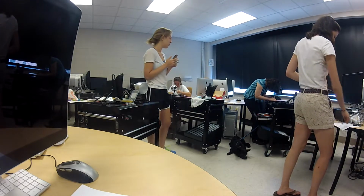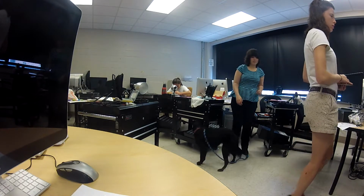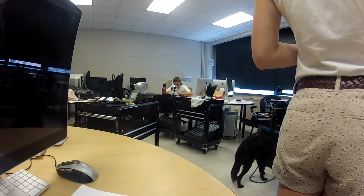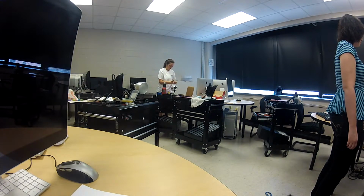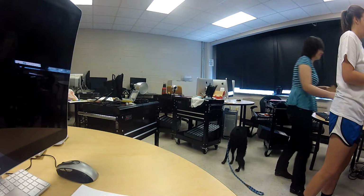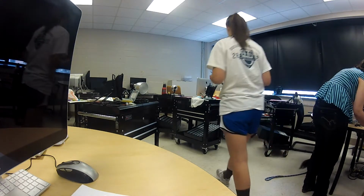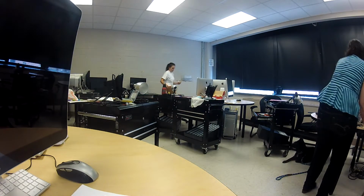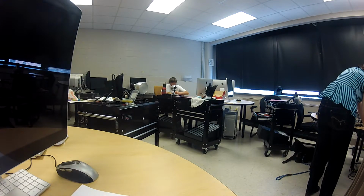So can I borrow your little socket real quick? So you have your cardboard, right? And you've marked all of its little pins. So now you look at your schematic, your circuit diagram, and you just draw what you see. So I see this pin right here, number 3. I'm going to draw basically a line coming out and then going up. I see this pin over here, the very top pin, and I'm just going to draw a line going over here and then all the way down to the bottom. Then I need one more line at the ground, like that. And then I need one line coming out for the butt. That just goes down like that. Then you can label them if you want. Butt, mouth. Then we use this as a guideline for laying down the copper wire, the copper tape. Got it?